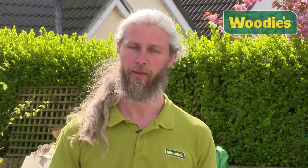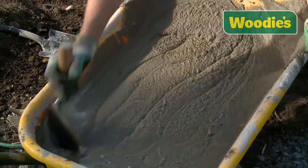The next thing we're going to do is sit our frame back in place. To do this we'll use a concrete mix — three gravel to one cement, which is a really strong mix. This is needed in order for the frame to stay in place.